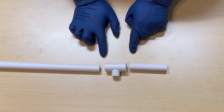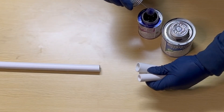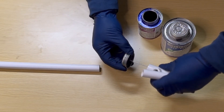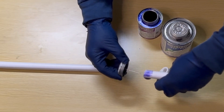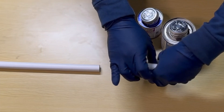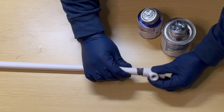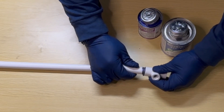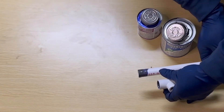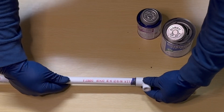After this point the shafts can be connected to the T-joint. Treat it like any other PVC pipe: take your primer and apply it to the inside of the T-joint and the exterior of the shaft, coating all sides evenly, then take your glue and do the same. Insert the shaft into the T-joint, twisting slightly about 30 to 45 degrees, and hold it in place for about 30 seconds to one minute. Then repeat the process with the other shaft, applying primer and glue, inserting, twisting slightly, and holding.